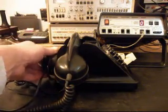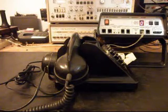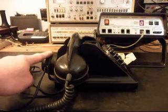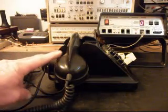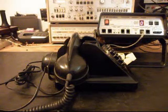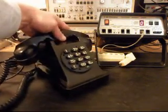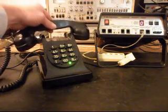Basically, we wanted to keep the original working design of the telephone for the handset, for the receive and transmit, and the receiver capsule, the mother-in-law receiver, because it would take that type of design to run both of these at the same time. Most modern boards wouldn't have the power or the capability to push two receives. So we wanted to keep that the same, and that's exactly why we hybrided it with this board for the Touchtone. But we'll give you one more look at it.